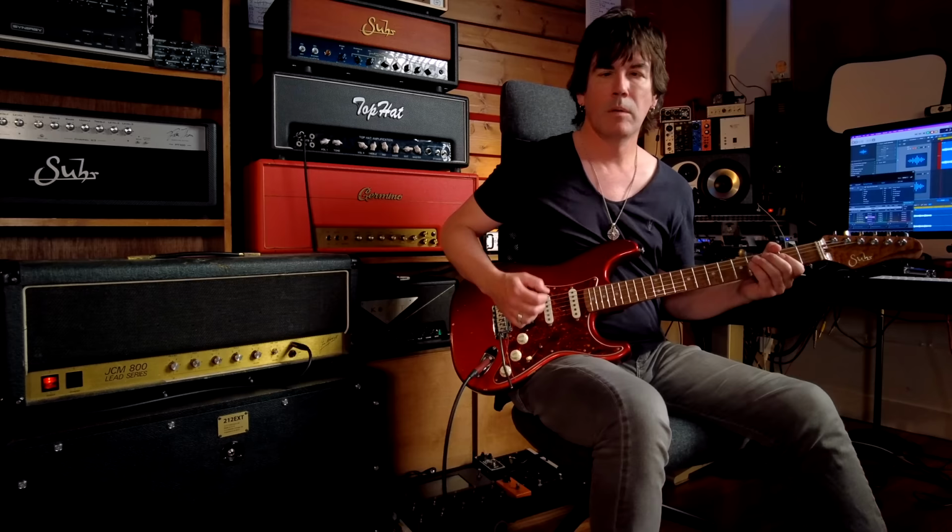All right, so first off, let's just listen to the first few bars of that song one more time, but with the guitar soloed, so you can clearly hear the stock sound of the JCM 800 amp with the preamp gain all the way up on 10. And then the sound with this module added in V2 tube position, and I've backed the gain on the amplifier down to like 7. The bright cap comes into play, you get a little more articulation and tightness out of the amp, but you get all the gain out of the module. Okay, let's check it out.